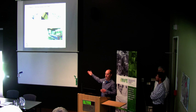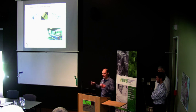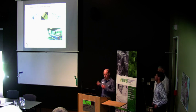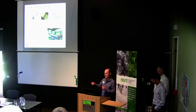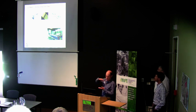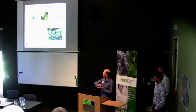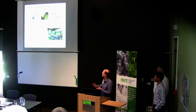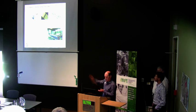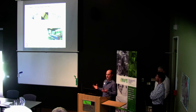The press is basically a bath — it's a vacuum press, so it's done with low impact and low energy consumption. We lay the planks into the press lengthways, then crossways, then lengthways again for a three-layer panel, and so on. In between each layer we go over the planks with a glue spreader, using a PUR glue which is a moisture-cure, waterproof glue. We then lay the membrane over the top, suck all the air out, and create up to about 500 tonnes of pressure in our press.